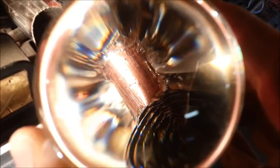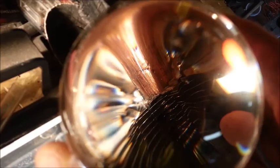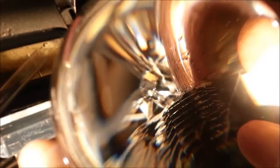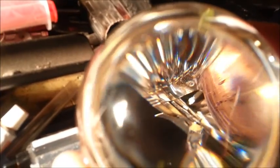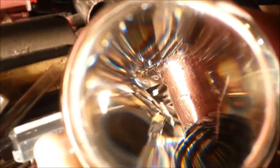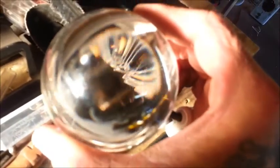You see those pits right there — those are the little pits caused from sodium hydroxide corrosion on copper. This radiator was hooked up to an electrolysis cell, which may have attributed to the corrosive nature. There are the pits that were leaking; it was a really slow leak. I basically just put some goop on there and I'm heating it with a light using a crystal ball magnifying glass — can't see it without it.